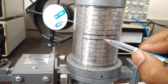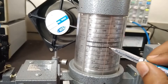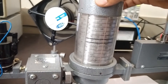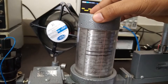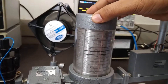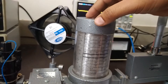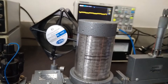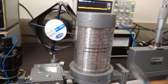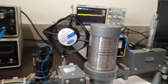The reading is between 9.54 and 9.58, so in the middle we can consider it to be 9.55. The guided frequency is approximately 9.55 GHz. You can take 9.5 or 9.55. Next, we have to calculate the minima.